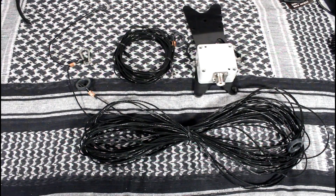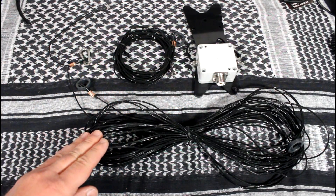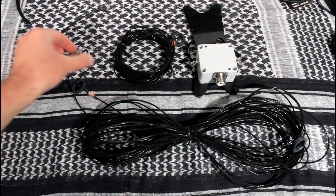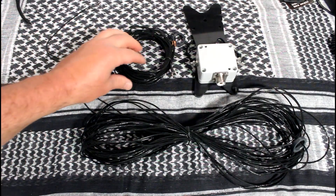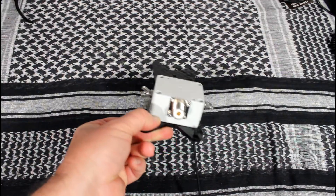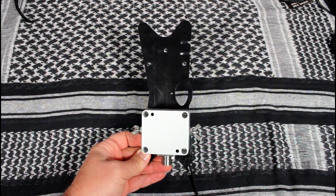The MCOM-3 consists of three main parts. You have the matching transformer, which is connected to a line winder. Then the 73-foot long antenna wire, which comes with two isolation loops — one at one end, a floating one, and a carabiner at the other end. And the 25-foot counterpoise, which also has an isolation loop attached to one end. There are three connection points on the matching transformer: one for the antenna, the SO-239, and the port for the counterpoise.